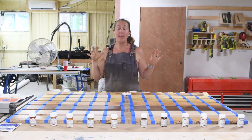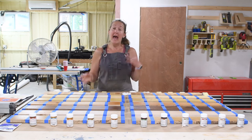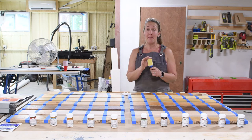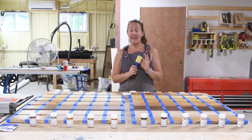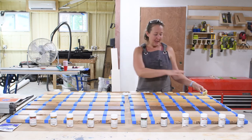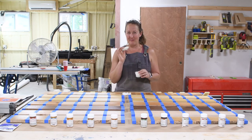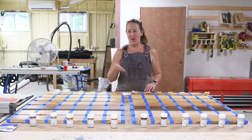It's been two days since I applied the first coat of sealer. I applied the second coat of sealer yesterday to all of the boards that needed it and the different sealers that needed it. Now I'm ready to apply the finish — the first coat — to everything. I've started by laying out the different applicators I'm going to be using because it is a little bit different. For the water-based H2O LOX I'm going to be using a paint pad. These come in all different sizes — the most important thing is to make sure your paint pad is made for all stain types or water-based stains.